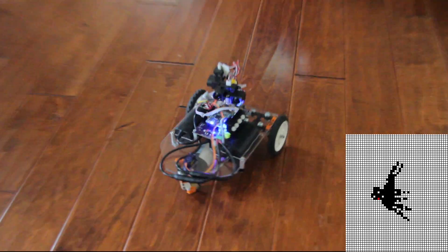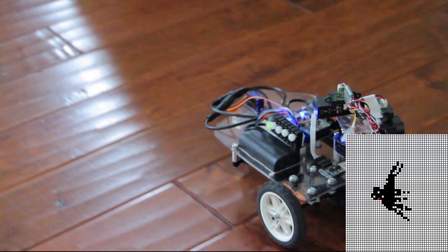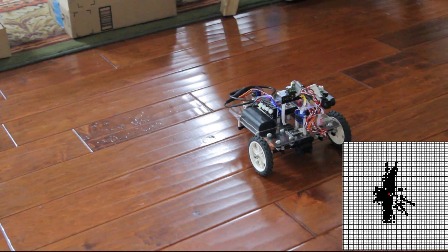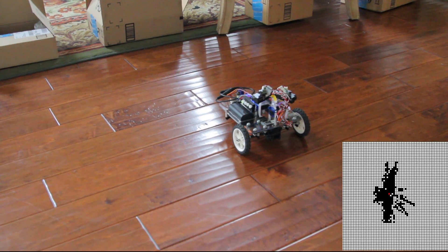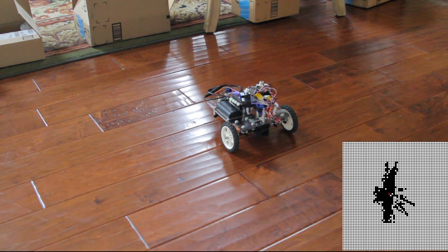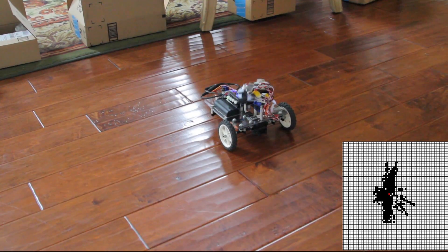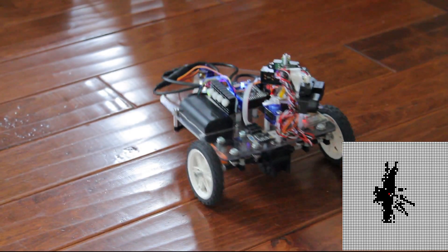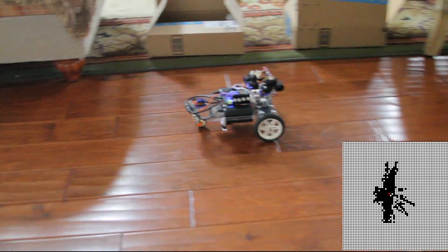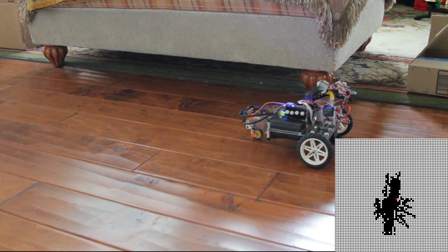There you can see the first scan of the robot. The current resolution is about eight and a quarter inches. You'll notice that a couple of squares tend to be full right around the robot. I think this is because my shorter distance sensor is not quite overlapping the long distance sensor. This means those squares are being left full, because the robot actually both adds and deletes things from the map based on where things are in its sensor range.